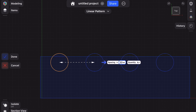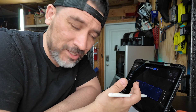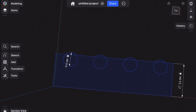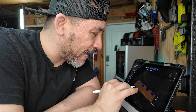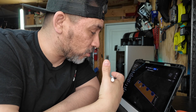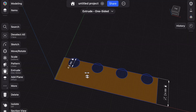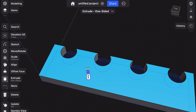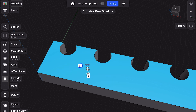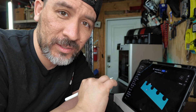We can change the spacing to the spacing we measured as well. Then once you're done, just hit done. Now you can see you have your basic shapes. If you select a particular object like our rectangular shape, it highlights and automatically selects the extrude function on the left-hand side. You have arrows that pop up and you can just drag your shape up. We can change that to the dimensions we want — say 6 millimeters, however thick we want that part. Just like that, you now have the basic shape for that particular part.